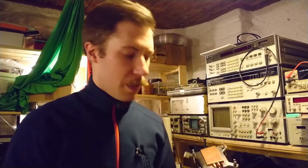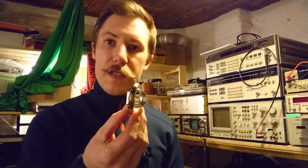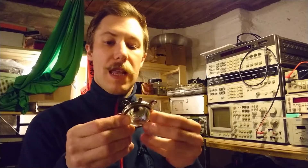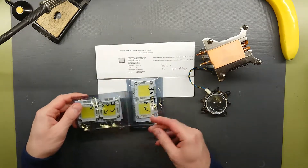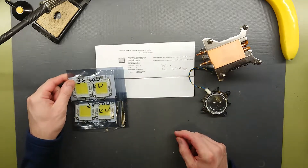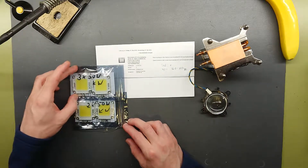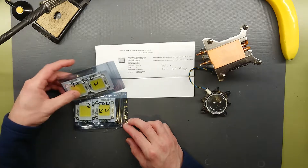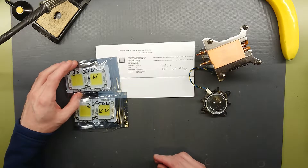For each of these LEDs I got a CPU cooler that I will use, and I also got a 60-degree lens for it. So let's take a closer look at these components. The five LED cups here are 50 watts each. They are 4500 lumens at the 6000K color, so these are cold, slightly blue in color. I bought these from a German seller.